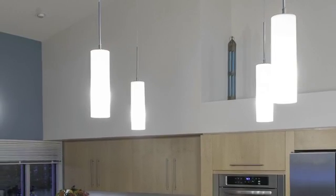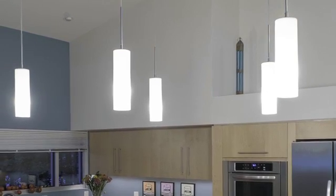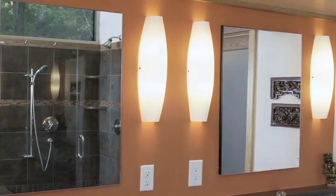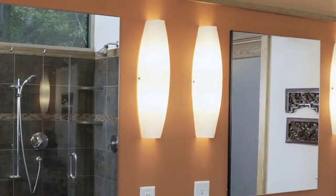Therefore, we have lower cost lamps that we can make for the marketplace. We started using a gel to cool the LEDs and get the efficiency of the light output, but we found that didn't work as efficiently, so we moved to a liquid solution. At that point it cooled them very well, but the lamp geometry wasn't made to cool efficiently whether the bulb was base-up or base-down. So we had to bring the LEDs to the center of the bulb so that the convection cells could cool efficiently — whether the bulb was in a ceiling, a lamp, or a sideways sconce — allowing the convection cell to efficiently cool the LEDs no matter the orientation.